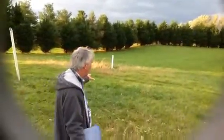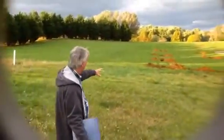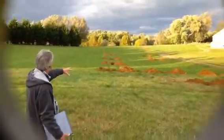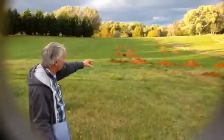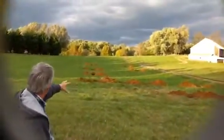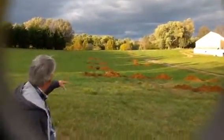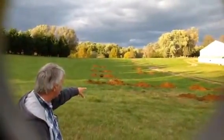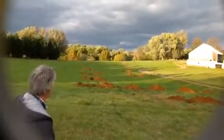As we go around, where we've been digging these holes is a general low area. Down in the center of it there's a culvert under the road. So it's a drainage basin that's probably four acres of land, and the low point is right there next to the driveway where we're putting these holes.